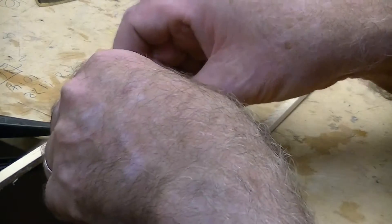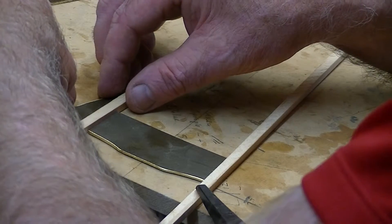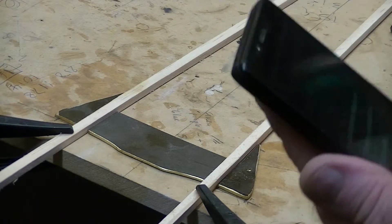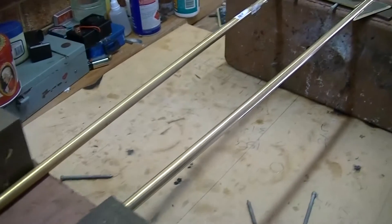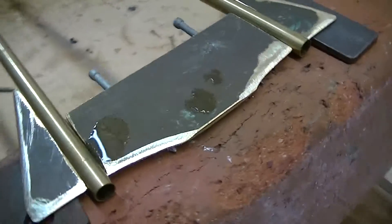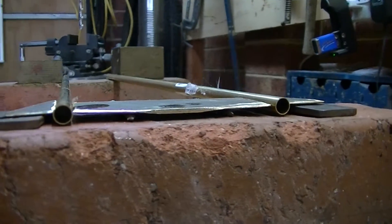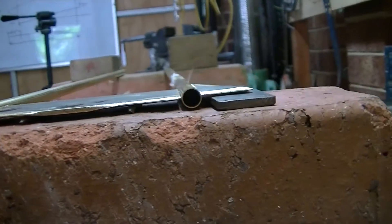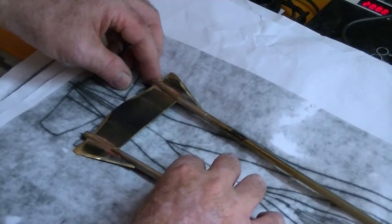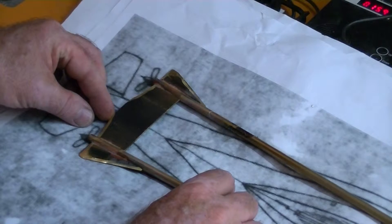I've got some timber here, set it all up clamped onto the bench, and I've got the little winglets that go on the outside. That should all be quite fine. I've set it up with the tube itself - the four mil tube, actually it's bigger than four - and I'm now ready to solder this. I've spent a lot of time setting this up with nails and bits of packing to get it to the point where I've now soldered it. That is securely in place and it perfectly mirrors the dimensions I require.